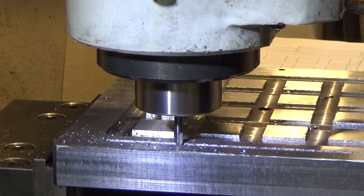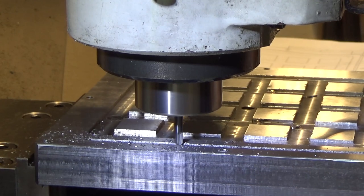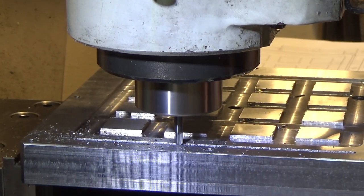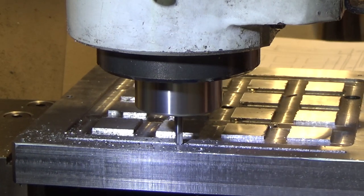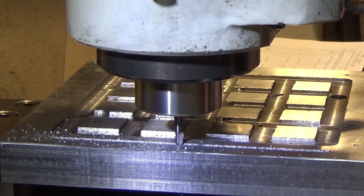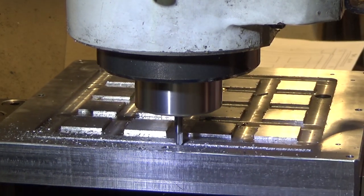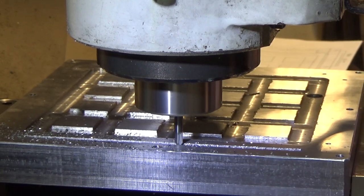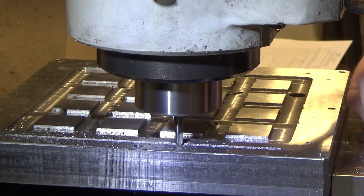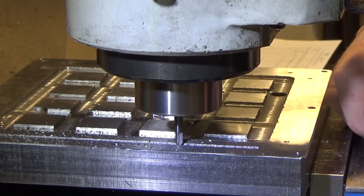On my way back for the final pass, the chamfer is there. It didn't show up very well on camera, but the burr is being removed nicely. I think I did this in three passes — my first go I was a little conservative. On the follow-up grooves I just did it in two passes: 50, 50, and then a 10 thousandths pass, which is what I'm doing now. It worked out pretty well.